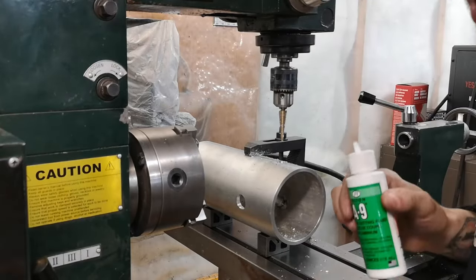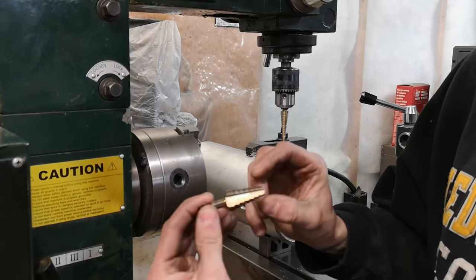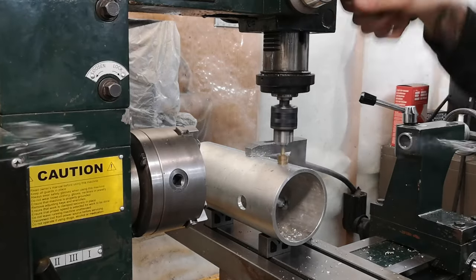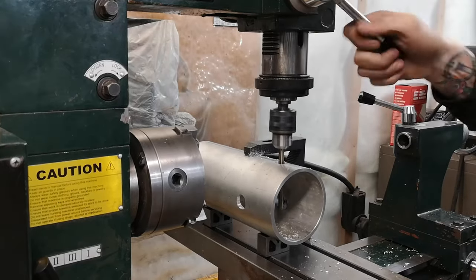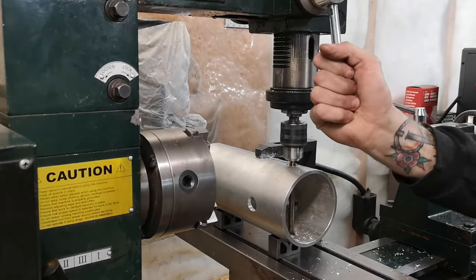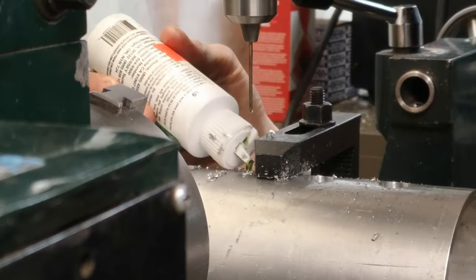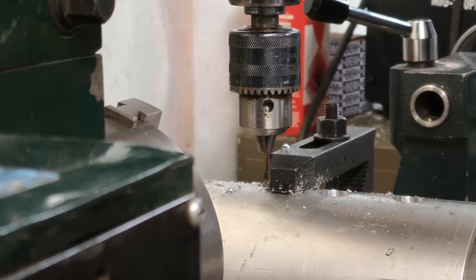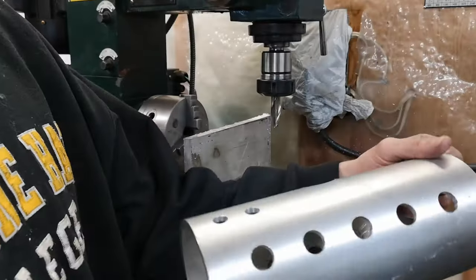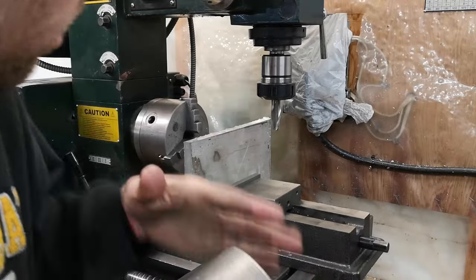I'm going to have to change the tool out every time so that I'm in line with the hole. I cut the end of my three-quarter inch step bit off because I had to drill a big hole in a tube and it was hitting the other side. So to use this thing I have to use a different drill to get it started. I went up in size until I found one that will reach the other side — just pokes through. I'm able to sneak a little drill bit in there so I can stick this in here, that'll hold me in line with the mill, and then I'll sneak this clamp over. This guy's all drilled out — all the three-quarter inch holes, the inlet holes, the cap hole, and the outlet hole. Now I've just got to work on the end caps.